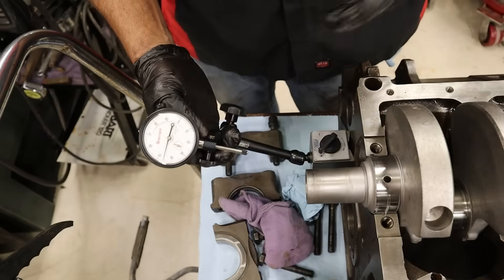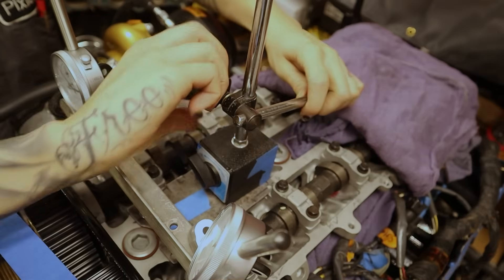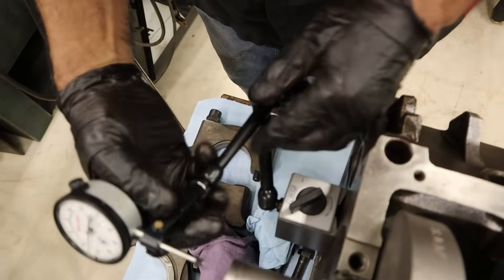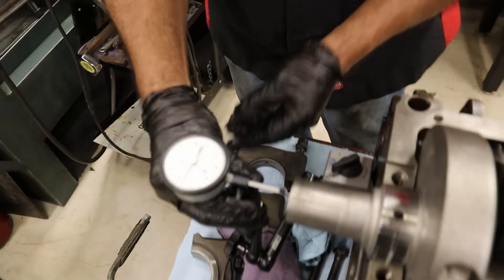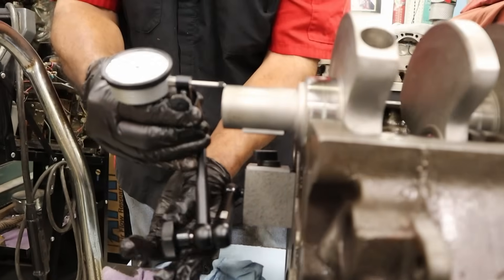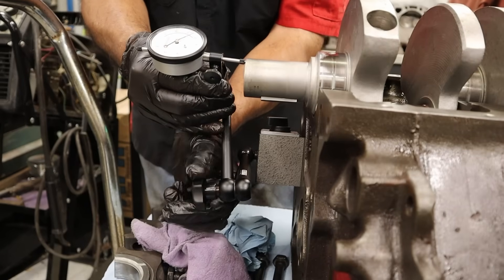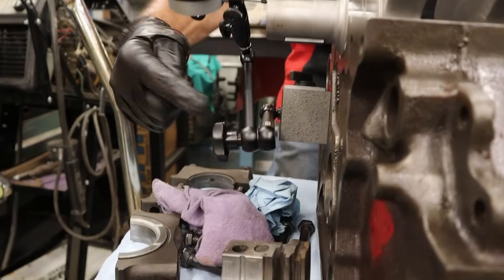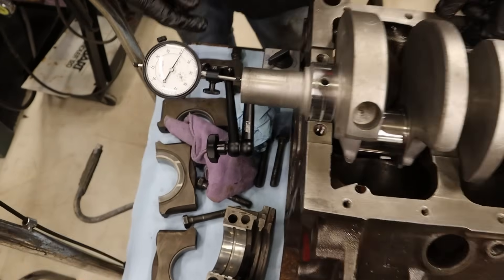Danny also loved my magnetic base. The old fashioned way had a bunch of nuts and I spent an hour to get it set up. But this one has these two little articulating elbows — they're almost like little ball and socket joints. You can see how easy it is to move it around and get it to almost anywhere you need it to be. We're going to put it up against the crankshaft, tighten this up right here, and that's it — it tightens up all the different joints with that one thing. And this one right here adjusts the way that the head is sitting.